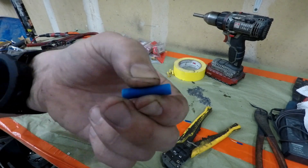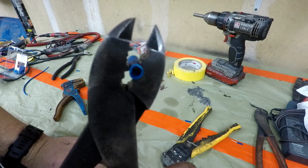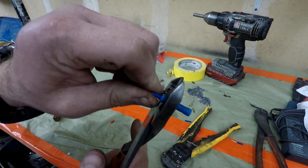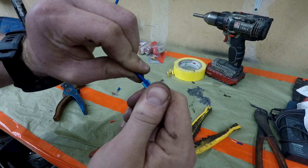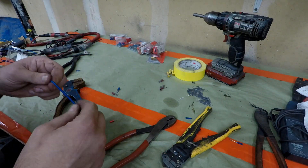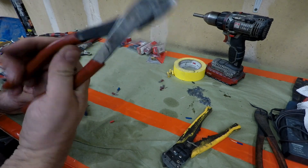Basically, what you do is butt two wires into each other. You place them in the correct part of your crimper, place them over a wire, make sure the wire goes all the way in, and then squeeze - that should crush it and make sure it doesn't come out. In a perfect world you could solder every connection, but for the most part this will handle 95% of the stuff you need to do. Just make sure you have a decent pair of crimpers.